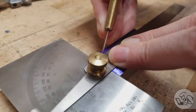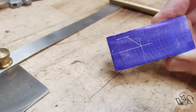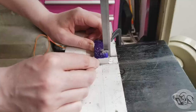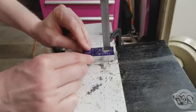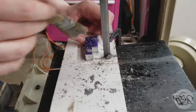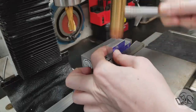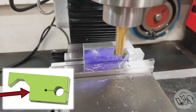These layout lines are just a sanity check — I'll be setting up the actual operations with angles and squares. I'm going to the bandsaw to cut most of that material out first; I think I can save time by starting with the fastest machine tool. I cut the main square chunk out, and also started cutting the little angled areas, but I was into diminishing returns. The bandsaw is not very efficient here — it runs too slow for aluminum and the vertical option on those cheap 4x6 bandsaws is pretty terrible, but it is better than nothing.